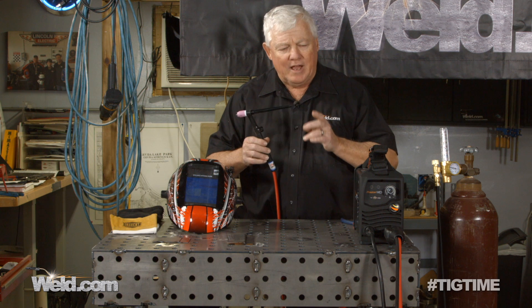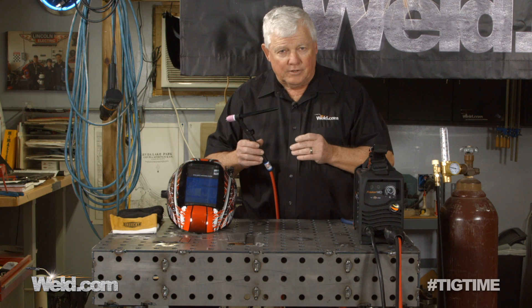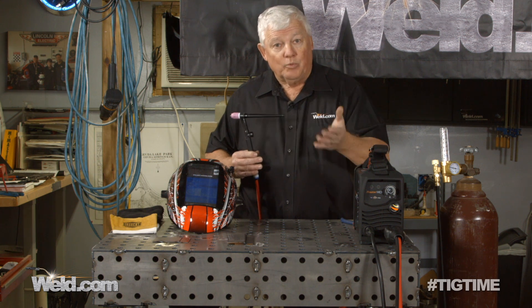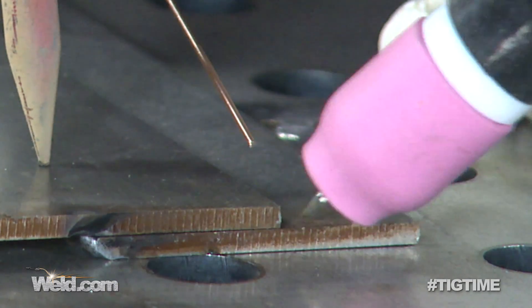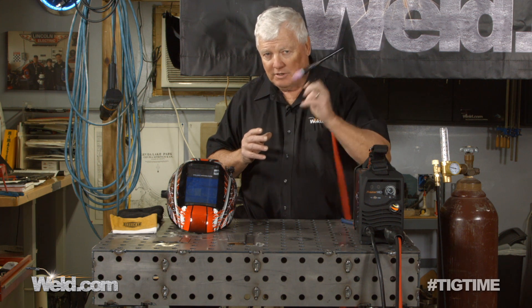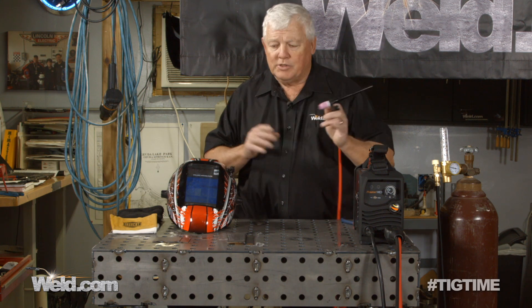One of the problems we've found in the past is setting the amperage. You try to find one amp per thousandth of thickness. I've got some sheet metal here that's about 30 or 40 thousandths, so I'm going to set the machine at about 30 amps and see if it really does adjust properly. This is a scratch start. Scratch starts should not leave tungsten as much as people think they do — there are a lot of power supplies, unfortunately, that do. You just do a little sweep; if you make contact, it should not leave tungsten. I don't have a foot control, so I've got to know by testing and resetting.